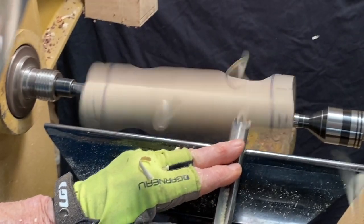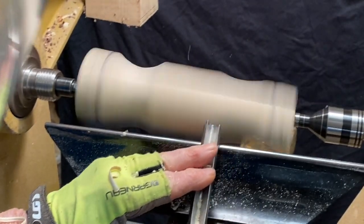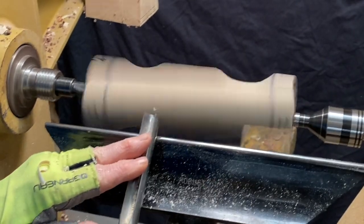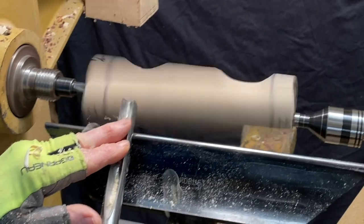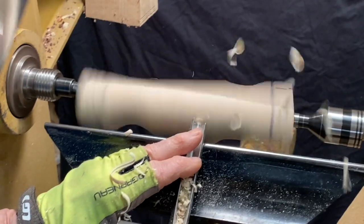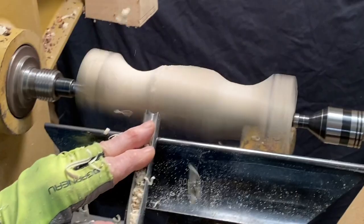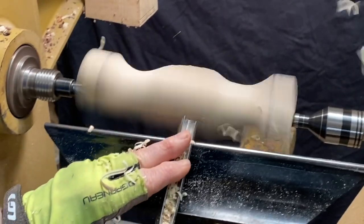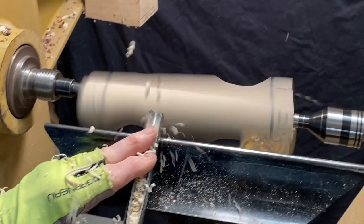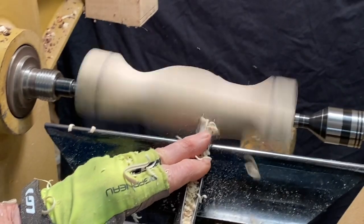You can see the airwood and the solid wood, and the depth of cut is an important aspect. There's no right or wrong answer — I could have gone a lot deeper on this first axis, but I'm looking at the solid wood and I usually go deeply enough to just about touch that solid wood. It wouldn't matter if I went so deep that I went into the solid wood, because when I change the axis it will turn into profiles intersecting with each other.